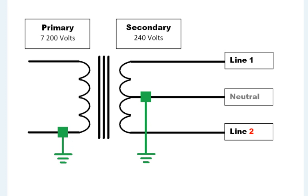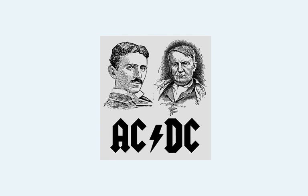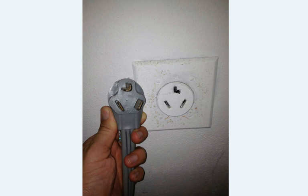Why do we use this? 120 volts was a compromise between Edison's original 110-volt DC supply and the increasing alternating current supplies on the market. The reason for using two voltages is to more efficiently run high-power loads like stoves and dryers.